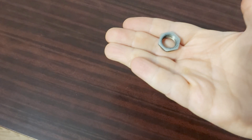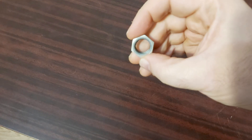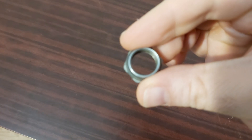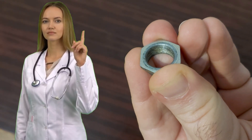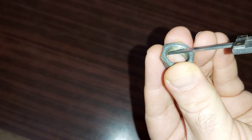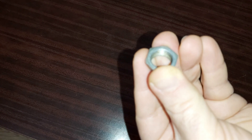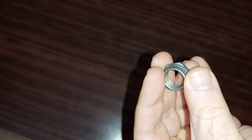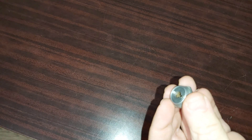As you can see, this is the nut and this is the sleeve. You can also see that this nut has threads — one, two, three, four, five, six, seven. Only one of them must be visible. The moment you screw the sleeve in, let me show you — only one thread must be visible.